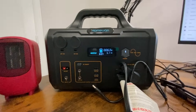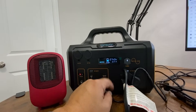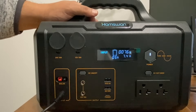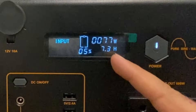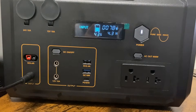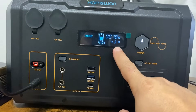It's really remarkable how much power one of these portable power stations actually has. For example, I can supply enough power to all the electronics here for almost six hours, even though this is only at 60% charge. I'm going to use my little heater to drain this down faster. At 4%, the unit turned off. It is now 5:05 and let's let this charge up. If the display is reading correctly, it will take 7.3 hours to charge to 100% — we are charging at 77 watts currently. Almost 3 hours later, the unit has charged up to 43%, and it's showing another 4.3 hours to reach 100%.